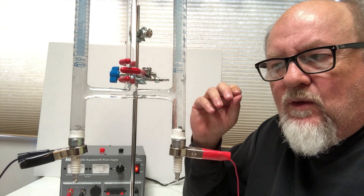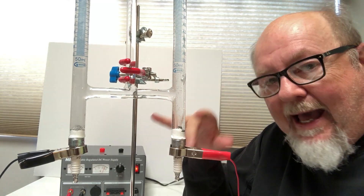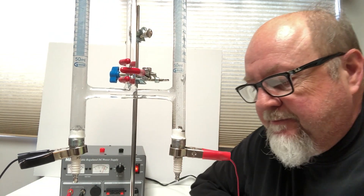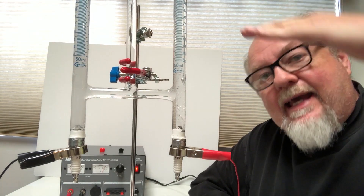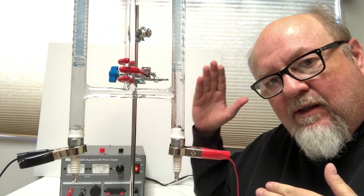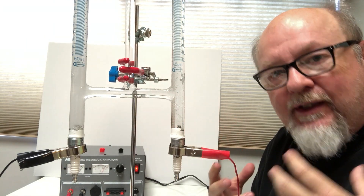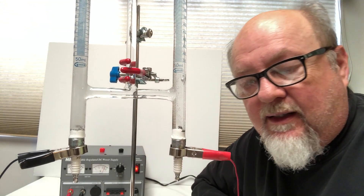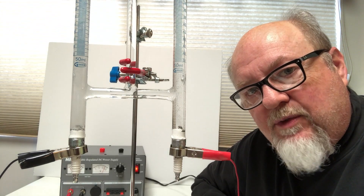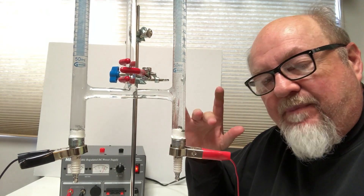Will you be able to use electrolytes? The answer is yes — you can use electrolytes to get more performance out of the tubes, out of the apparatus, out of every watt-hour that comes out of this box. When you're measuring the gas, you have a standard number of milliliters of gas over time per amp or per amp-hour — however you want to do the math. These graduated cylinders in the Hoffman apparatus are really golden for that. There's really nothing homemade that's going to do as good a job of measuring the two gases coming out of an electrolysis reaction.